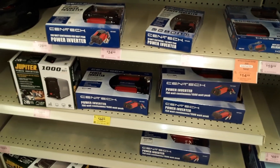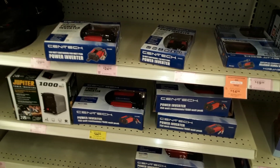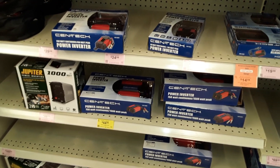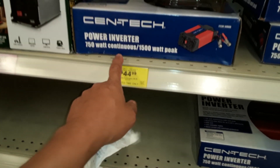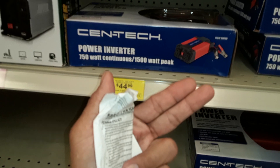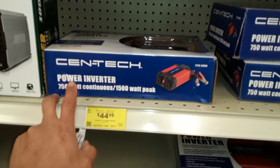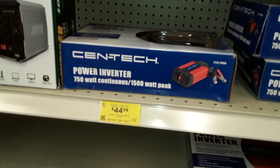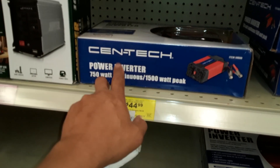If you want to get more elaborate and cook in your vehicle, you're going to need a little more power. I actually use a 300-watt rice cooker from Walmart — if you want to learn more, watch my playlist 'Cooking with Denoy using the inverter cooking system' to see how I cook using a 350-watt inverter and a 300-watt rice cooker. You can pick up an inverter that's 400 watts or more. I recommend something like this 750-watt unit. You want to get more than you need — and importantly, that's 750 watts continuous, not peak. Peak is when you first turn things on; it jumps up then comes back down. With 750 watts you can run a rice cooker easily, and even two small rice cookers at 300 watts each would only be 600 watts total.